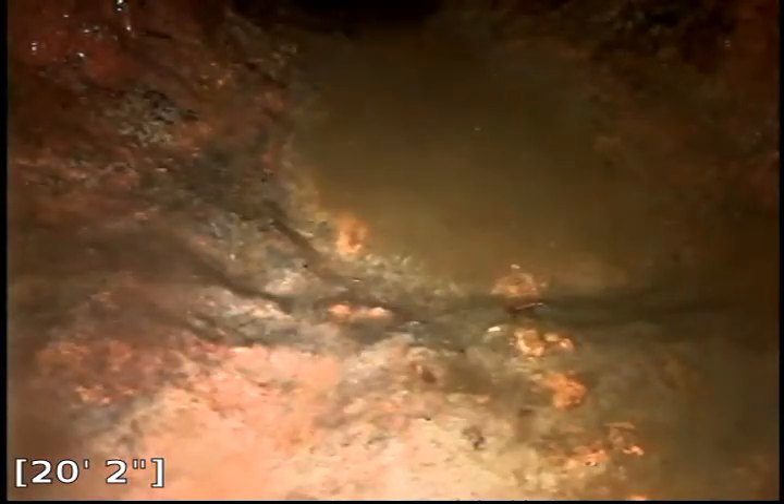We're keeping pulling back to locate the line as it comes across the front yard, so we can notate the path in case someone needs to change out the cast iron pipe and know where it transitions to clay. Pausing at the hub — we're in the front yard about six feet into the yard from the street, and the pipe is about five feet deep here. We've marked it with a green dot. Continuing to pull back to find where the horizontal clay ends and transitions back to cast iron. Here's that transition — just over ten feet from the street. This is the spot where the cast iron ends and the clay begins.